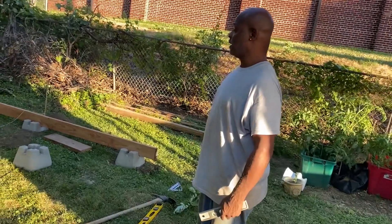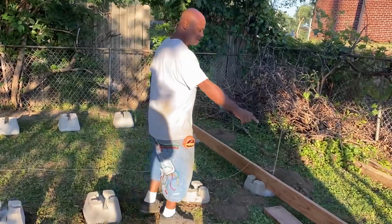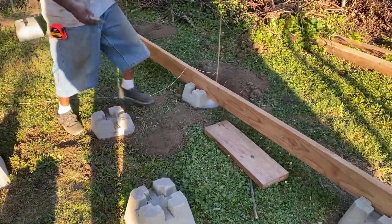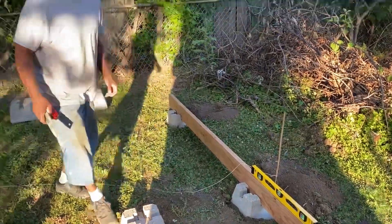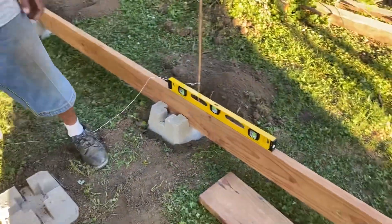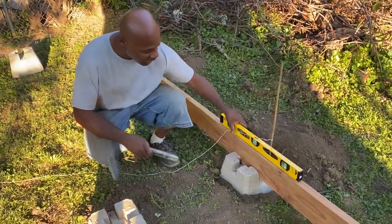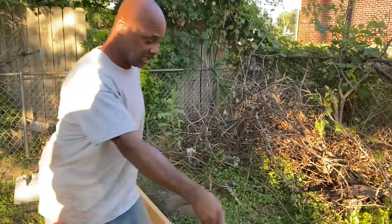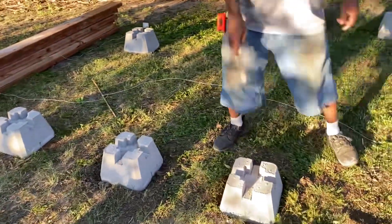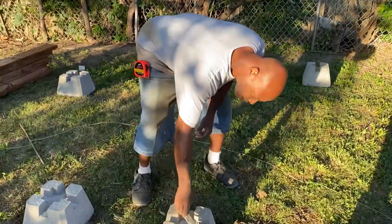Okay, so Larry's showing us the work that he's done since the first time. Some of his deck blocks he had to dig into the ground because his yard is not level — it has like a slant to it — so he had to dig those blocks in. Now he's just checking to make sure everything is level. He did such a precise job, really really good, explaining how he made sure each one was level, and as he went up higher he didn't have to dig the blocks in the ground.